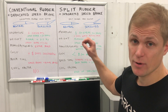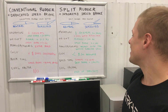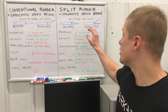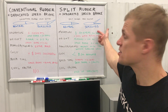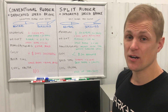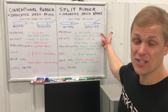One operational disadvantage of the split-style control surface is that it does have more drag than a traditional conventional control surface. However, the Dark Arrow 1 was optimized around a design point of high-speed long-range cruise, and in cruise you don't have much rudder deflection, so there isn't much disadvantage at our optimized design point. To offset this, the vertical stabilizer on the Dark Arrow 1 is very tall and skinny — a high aspect ratio — which makes it efficient at generating lateral lift, minimizing the deflection needed to achieve the desired maneuver.